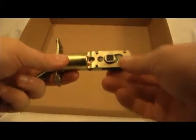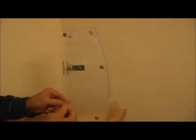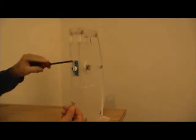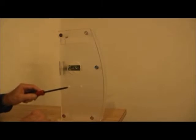We're going to insert the tail piece into a prefabricated acrylic stand so you can see how it all works. Here we have the two screws that you use to drive in the backset. You just drive two screws into the backset to hold it in — there's no orientation on the backset. Below the backset, you'll see two holes drilled into what would normally be the door. You use the template — wrap it around the door and it'll show you exactly where to drill the two holes.